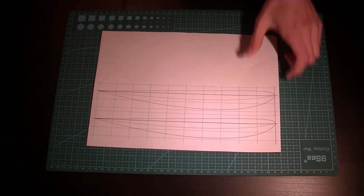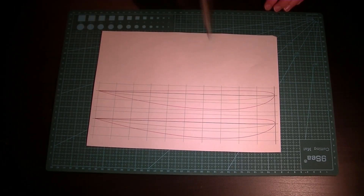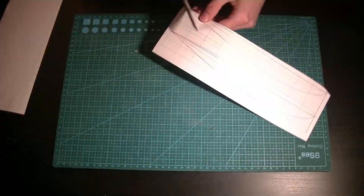I bought some components from China when this was still possible, and I bought a massive chunk of styrofoam at my local construction market. For the proper wing shape I used airfoiltools.com and took the Clark Y model, as this is widely used for RC airplane design.